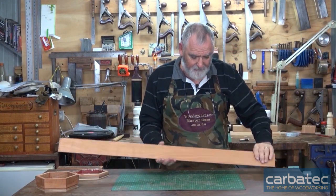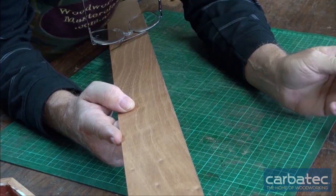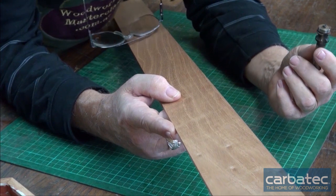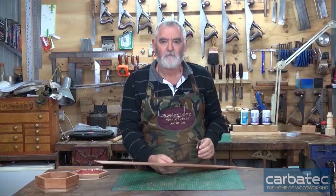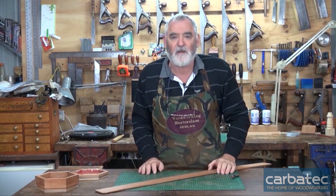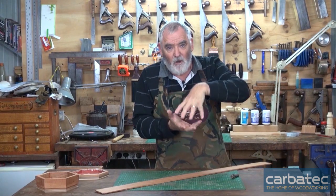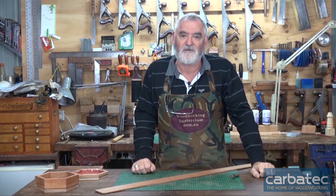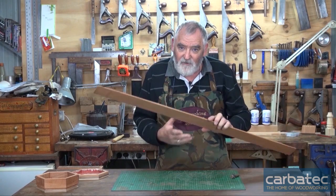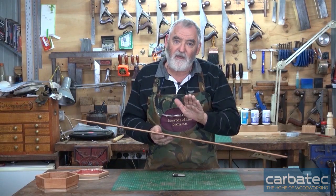While that's drying I went away and I've machined up this Spanish cedar. It's machined down to about 5mm - the thickness doesn't really matter but if you go too thin when you cut the angles on it you'll find it'll start to break away. 5mm works for me. The other reason I like 5mm is what I've got here is a bullnose bit, and with this 5mm board it fits nicely into this bullnose bit. If you don't have one of these bullnose bits, you can use a block plane to put a leading edge on, or you can wait until it's all in the box and then just sand a leading edge. The reason you want a bit of a leading edge is so the box top can be guided on and fit nicely on top. I'll go over to the router and run this piece of timber with this bullnose bit to get the round over, and then I'm going to set my saw up at 30 degrees.